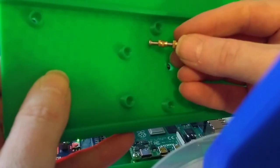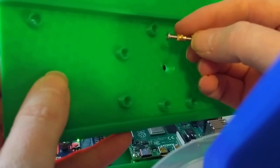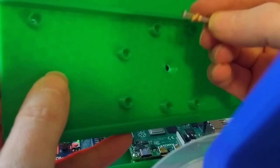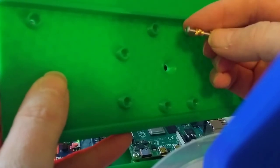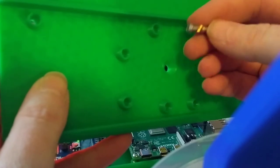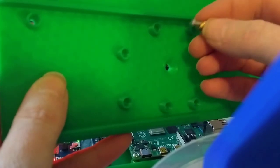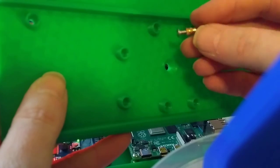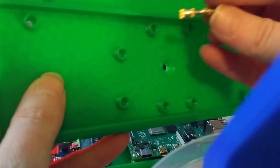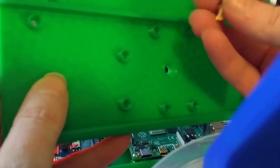Later on I'm going to start using these ones — this little one closer to the head. It's got a 45-degree twist on the knurling. These are made in Germany. As you can see it's much smaller and more precise, and because you've got this 45-degree knurling it gives you resistance to not only twisting forces from the screw but also the pulling forces of the attachment. So these are going to last a bit longer and are also going to be neater because they're so much smaller than the Chinese ones.